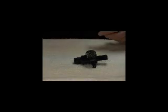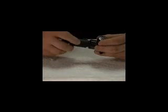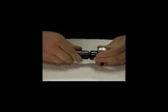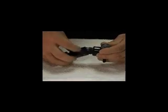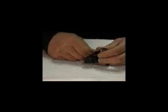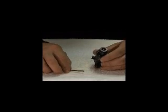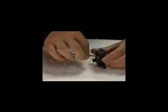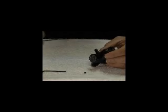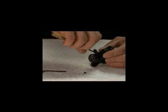First, make sure the bottle has no air in it. Screw on an ASA or adapter and safely bleed all the air out. Remove the ASA and push the pin valve. You should hear or feel no air coming out. Then, using a 3/32 Allen wrench, remove the two bonnet screws. A ball Allen wrench is useful to getting the screw behind the gauge.